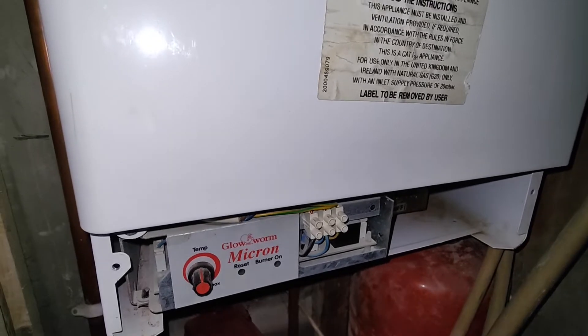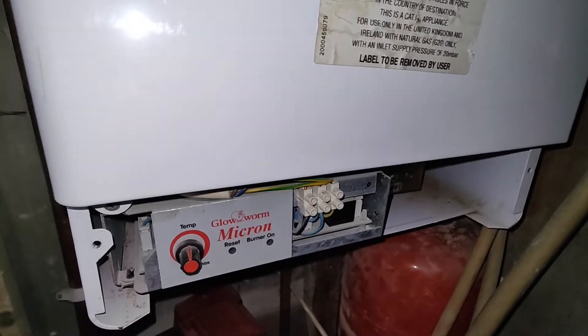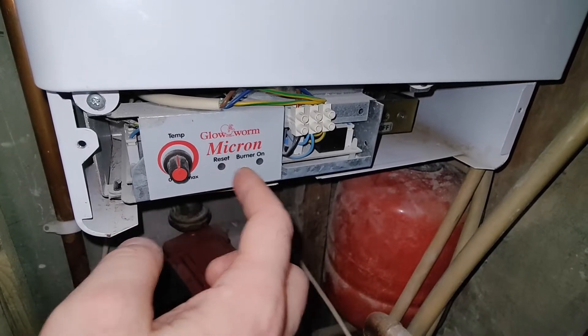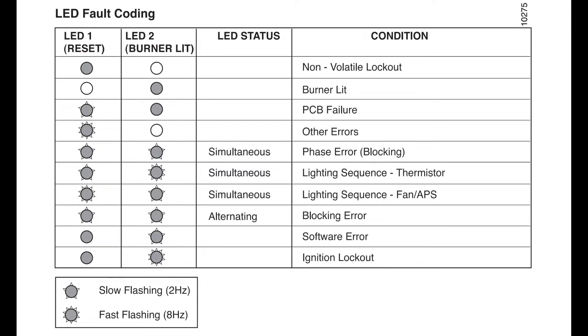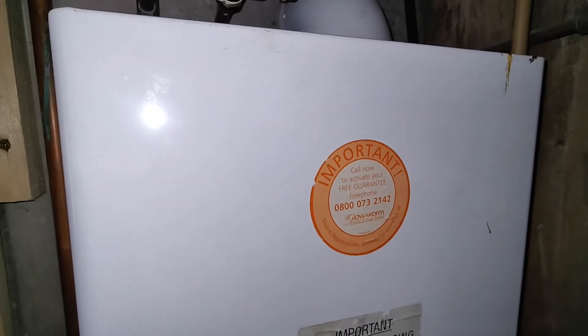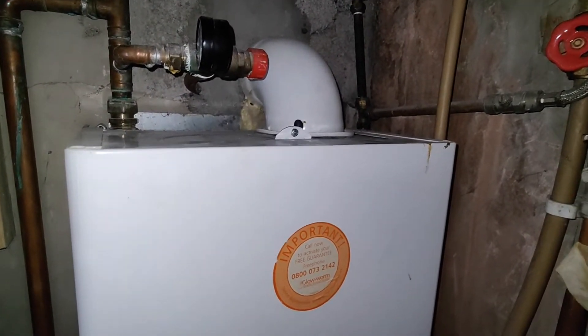I'm having a quick look at this boiler. I have an intermittent problem where it sometimes won't start. At the moment I have it up and running but I have this cover removed. You can take the cover off the boiler and you'll get some blinking codes — either fast or slow — and there's a chart I'll add to the video that describes the diagnostics. Combined with the noise it's making, my suspicion is it's going to be a bearing, so I'm going to fire it up and see if the noise comes through on camera as the fan gets going.